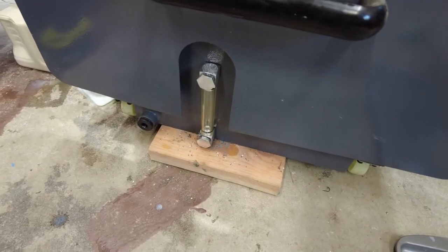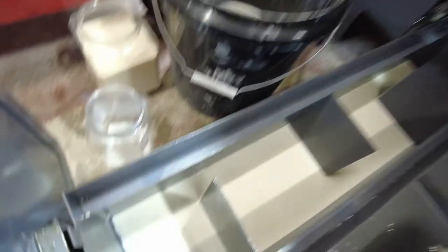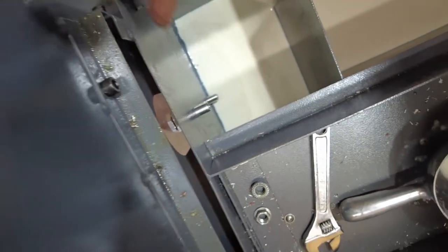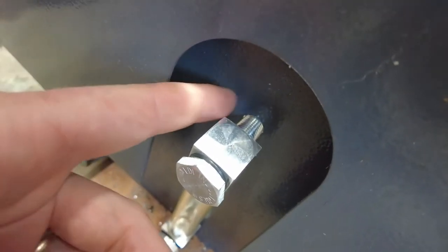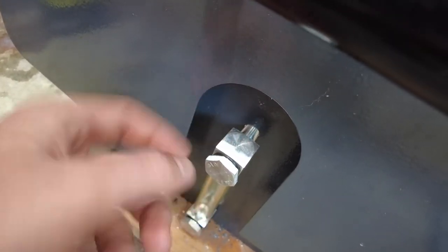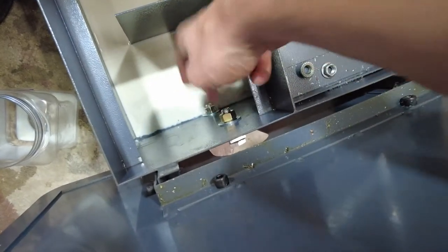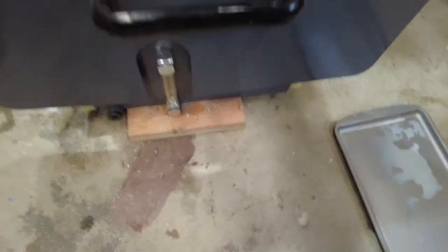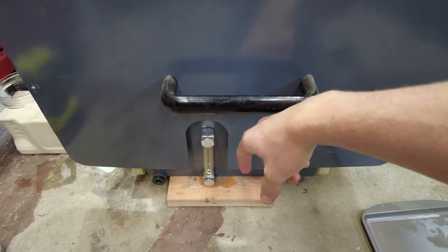No going back now, guys. I filed those holes a little bit so I didn't damage my O-rings when I inserted this — looks like it fits really well. I'm going to have to go get those nuts. It does appear to me that the O-ring has to be right here on the outside, so no O-ring on the inside. I pulled one of the bolts out to run to the hardware store. I went and got a washer and a nut to fit each of these — they are fine thread pitch, half-inch by 20 threads per inch. For tightening, because I've got O-rings in there, I'm just going to hand tighten and then give it maybe an eighth or a quarter turn with a wrench — you don't want to crush and ruin those O-rings.